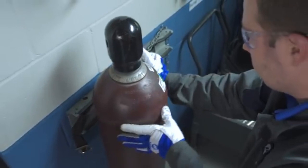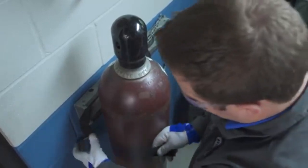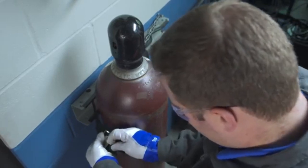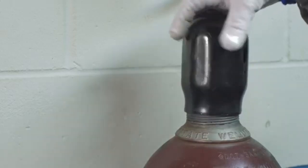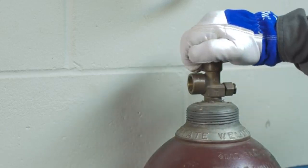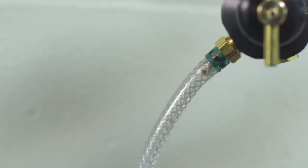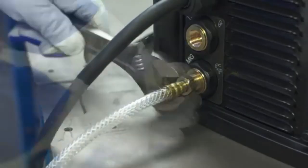Finally, let's review gas setup requirements. Your Multimatic 215 is designed for external gas cylinders. Before connecting your Multimatic 215 to an external cylinder, securely fasten the cylinder to a running gear, wall, or other stationary support. To attach the gas to your machine, remove the cap and stand to the side of the valve. Open the valve slightly to allow the gas to blow away any dust or dirt from the valve. Install the regulator so that the face is vertical and tighten with a wrench. Then connect the hose to the regulator — slide the hose over the fitting and clamp. Then connect the hose to your machine and tighten with a wrench.